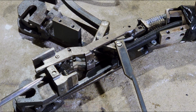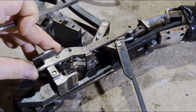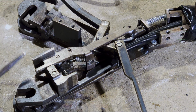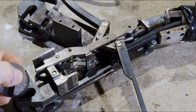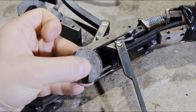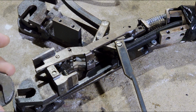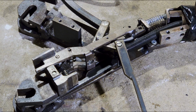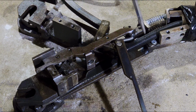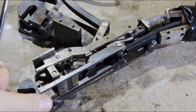And when this little detent pushes on this lever and moves this slider down, what happens is those catches move downwards, and those tiny little locking corners I showed you earlier, those tiny ones down here, oh, that's a good angle, they are basically no longer catching, and the discs can rotate, which in turn allows this spring to move the seesaw down via those arms.